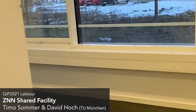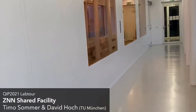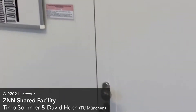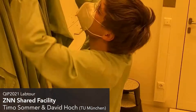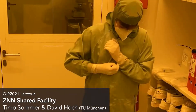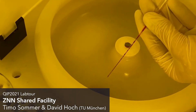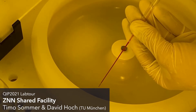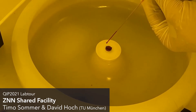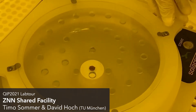This chip will only have some silicon nitride membranes on it. Let's enter the clean room through the changing room. Our first step today will be to spin coat some photoresist onto the chip. The red liquid in the pipette is the photoresist. We drop some droplets onto the chip, close the lid and start the spin coater.